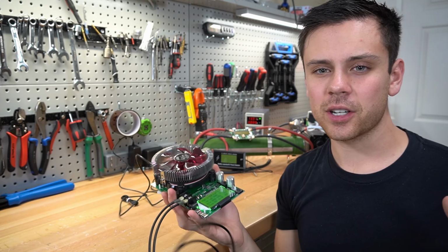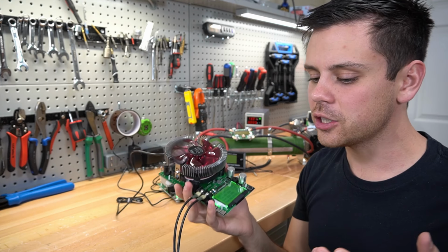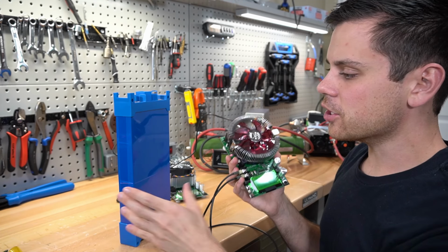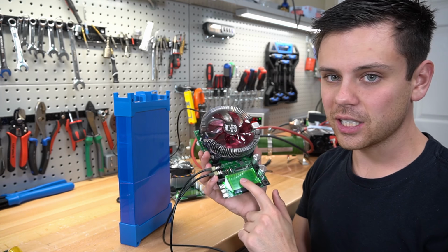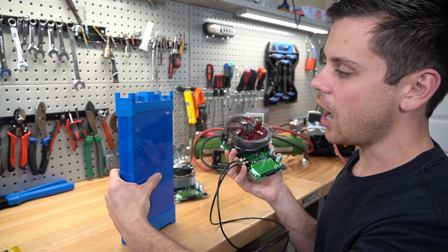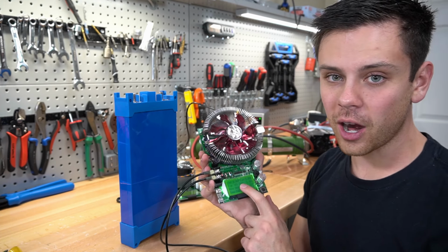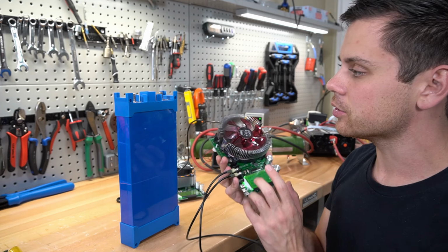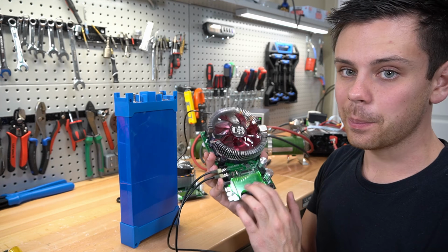And so I think it's smart to have a shunt or a Hall effect sensor on your system, but if you want to do individual cell testing, I would absolutely use this. And if you're just testing a single cell, you can actually add a low voltage disconnect. So for this, because this is lithium iron phosphate, I would add the disconnect at like 2.6 volts. So I can actually program it on this screen and it only has a single button, so it's very easy to use, so that when this battery is down to that voltage, it will stop the test.